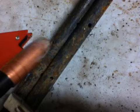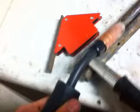You put one tack on this end, and then that's when you do your bead. When you're actually doing welds, you want to do little circle motions — almost like L-shapes — and you want to go real slowly at a steady pace. You want to really kind of stack those beads up and make them somewhat wide so that you can get the metal to actually fuse together, because it actually melts the metal. A tack weld barely melts the metal — it's just barely holding the metal together, just enough so that you can do your actual bead. People just think you take the gun and just go — but it takes a little bit. I'm not a professional either, but I think if I try a little harder, it's getting a little better.